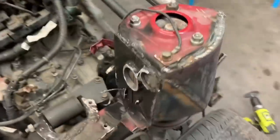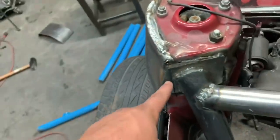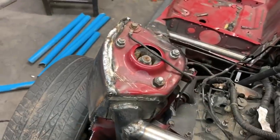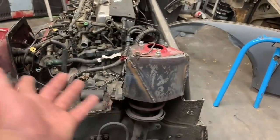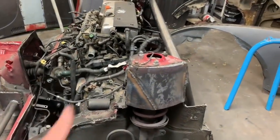Parts of this up there I got a little squirrely because some of the seam sealer didn't clean out all the way, but the rest of that is pretty dang good. That looks sweet, that looks sweet — so that's boxed in. This is going to be super duper strong because there's a plate here, roll cage is going to attach to that. The outside and top of that is plated off and it's got this plate here which is connected over there, so that should be ridiculously rigid and secure. That diagonal cut just looks like I know how to do stuff. Mic drop.